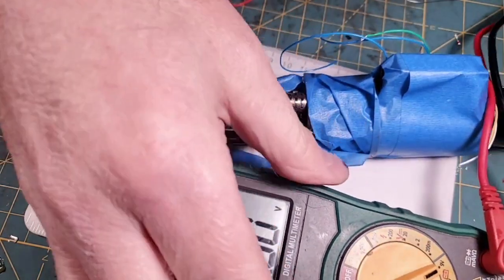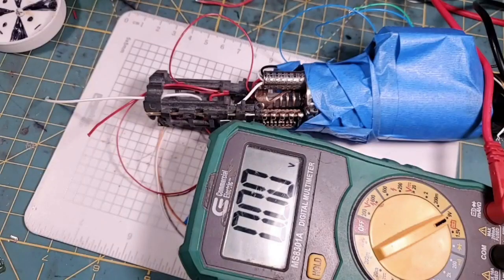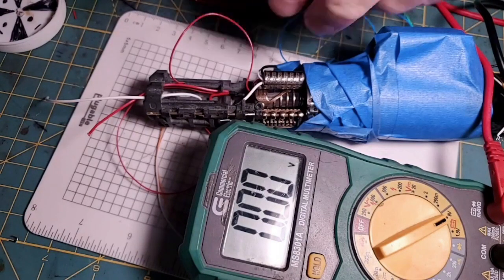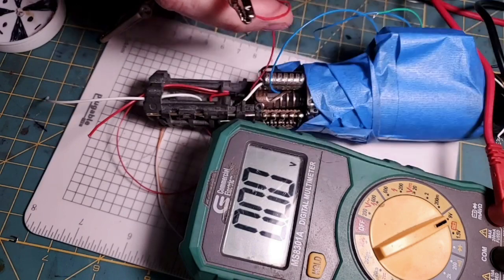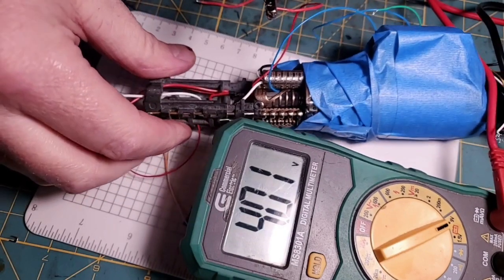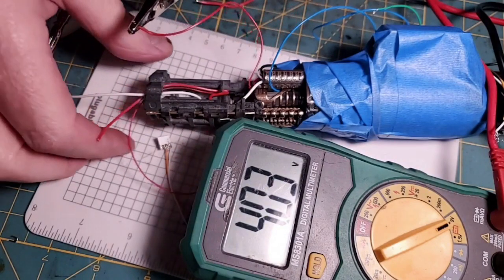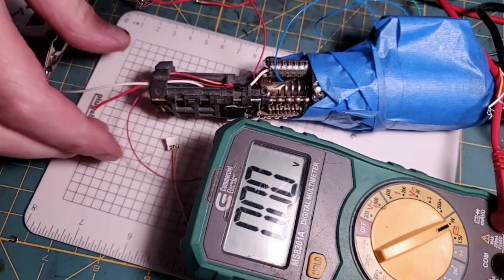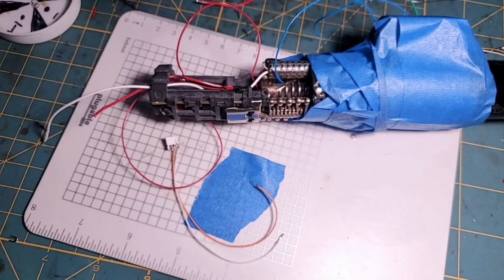And by the way, since I last left y'all when we were filming, we were trying to get it to where you guys can see the voltage. But at any rate, I've got my multimeter set to the 9-volt range. I'm going to attach my positive clip into the red wire that's going to feed our Neopixel crystal chamber. And I'm going to attach the negative lead to our white wire. That's our battery negative. And I'm going to turn the kill key. And so you can see that I'm getting 4 volts through this red wire, which is our positive that's going to feed the crystal chamber. Now I'm going to twist the kill key and turn the battery back off because I don't want a live battery while we're working here. And we're at 0 volts. So I know that red wire has positive running through it.